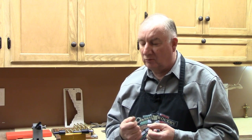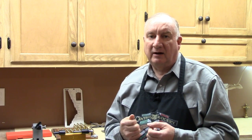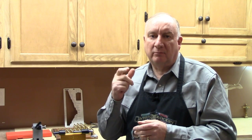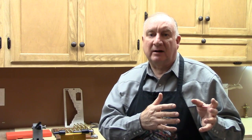The preservation of the case then is something that case neck sizing alone will accomplish. It also accomplishes some degree of conformity with the chamber. In other words, the brass becomes a clone of the chamber. If you're going to use brass in the same rifle all the time, then you can use fire-formed cases which are neck-sized only in that chamber. You can't do that if you're going to use ammo in different rifles.